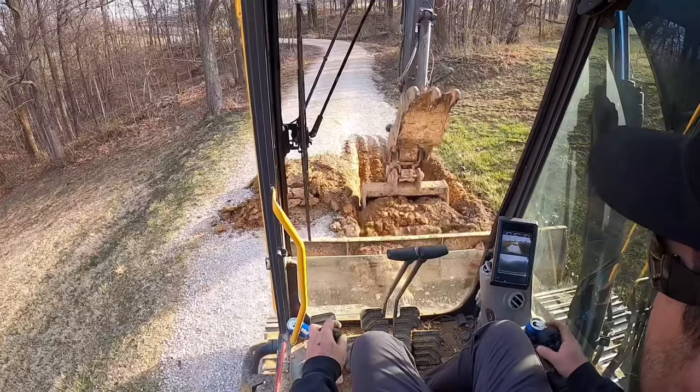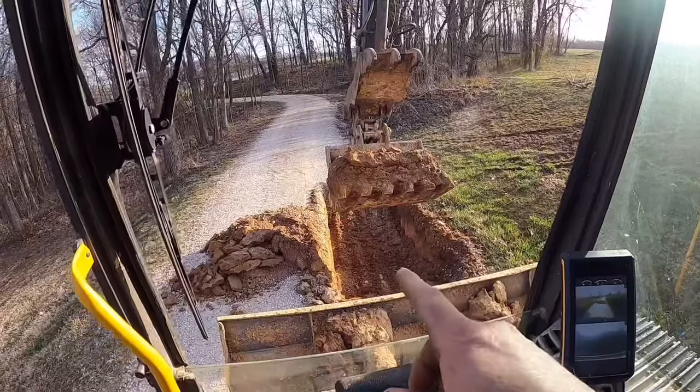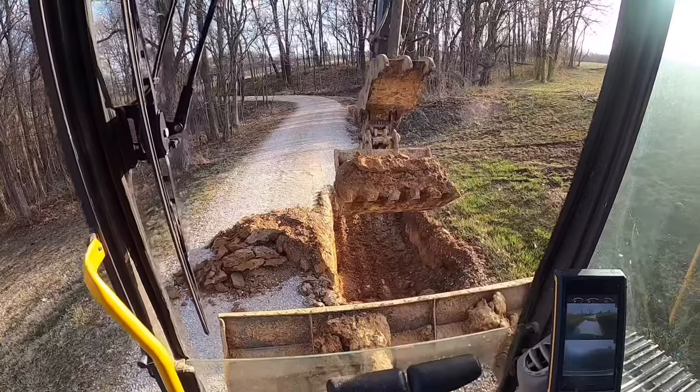Solid. We're almost on rock right there. It's a little bit different scenario than what I anticipated. I anticipated having a bunch of that nasty subsoil down there and then getting into this dirt, but I think what has happened is we got a thin layer of good dirt on top of rock, which has got moisture in it, which what we probably ought to do is run a tile pipe out of here. But if we fill that hole full of rock, I think we can force that water to the top and go down the ditch. So honestly, this might be a best case scenario here.